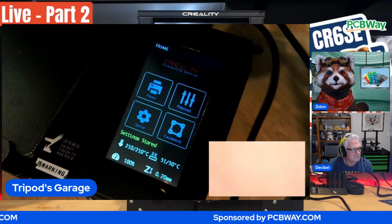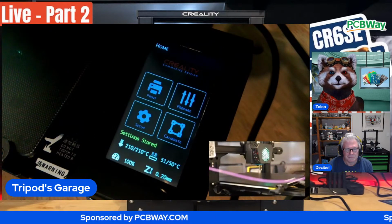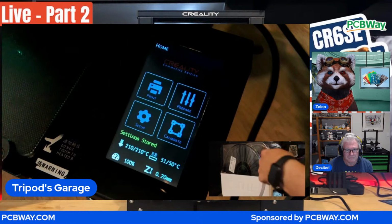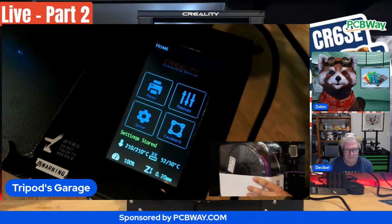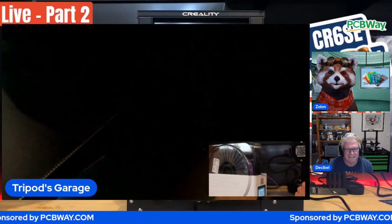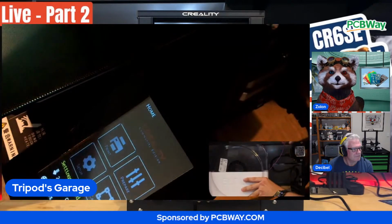And anyone that has a filament dryer, make sure that you do it that way. Sorry, let me back it up: where it's coming out of the bottom, not feeding from over the top, but coming from the bottom up, because it'll start hopping on you, and it will not be a good day. Oh yeah, mine crawled off the desk one day.